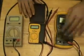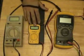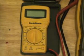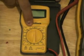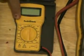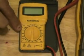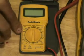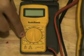Let's zoom in and look at this little pocket multimeter that I got from Radio Shack. It costs about 20 bucks, fits in your pocket. It's a pretty good multimeter, but there are some flaws. It has AC voltage up to 500 volts, though I wouldn't trust it past 60 volts, because these thin little leads — I don't think they can handle too much voltage or amperage. It has DC amperage up to 200 milliamps. Standard AA batteries will be between 300 and 330 milliamps, which means this thing can't even measure the current coming off AA batteries — one major downfall of this tiny little meter.